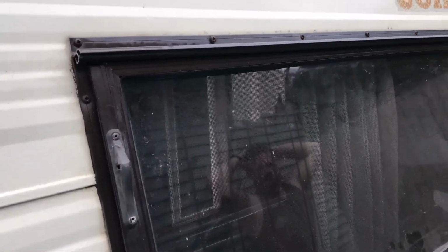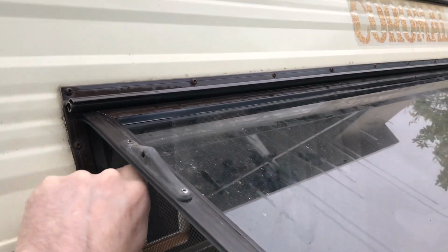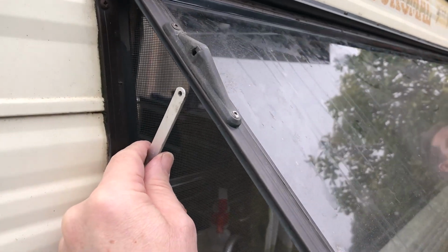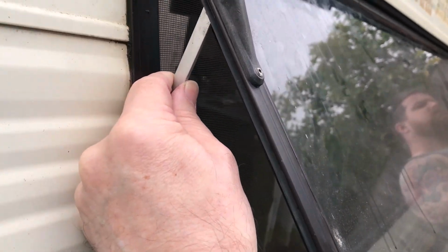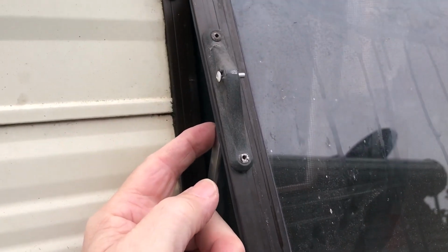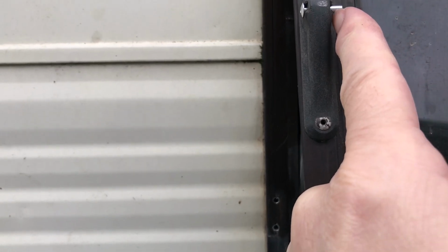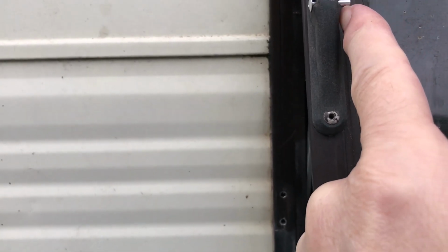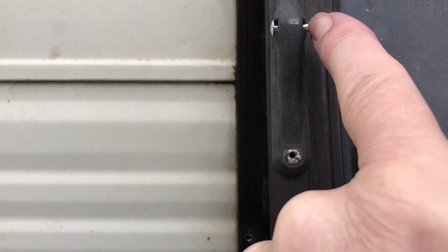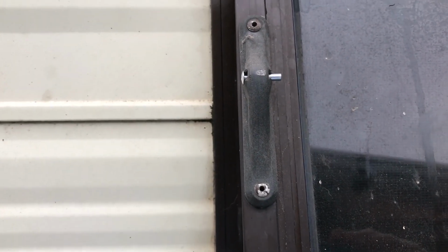Now the next bit here is to pull the window up, and we're going to pull the link arms, put the link arms inside the link box, and then put the rivet shells through. Now I've put the arms inside the link box and dropped the actual rivet shell in. Next bit here is we're going to bell over the end here so that this rivet stays in, because you don't use it like a normal rivet gun. You don't want to mess all this up, because this becomes an actual axle, so you don't want to have it distorted. You only want to distort the end piece to stop the rivet shell coming out. Let's go to the next step.